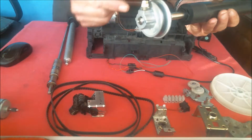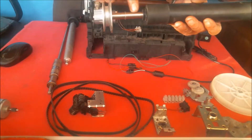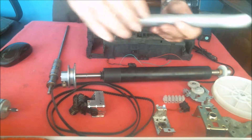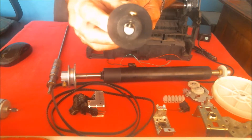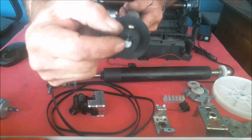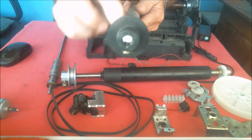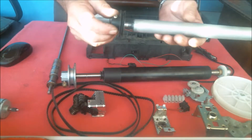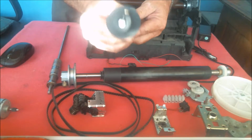It is important that the hole of the sheave should match perfectly with the diameter of the shaft. As you can see here, if it doesn't fit, the center point is different — the shaft has one center point and the wheel has a different one, so while one turns, the other will be jumping up and down. That will produce a problem in our system and can damage both the motor and the transmission parts.